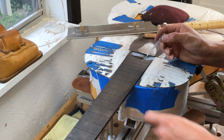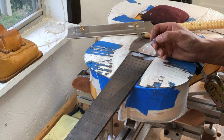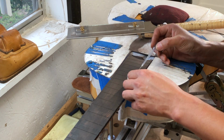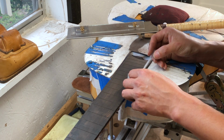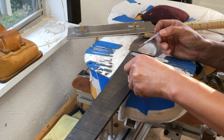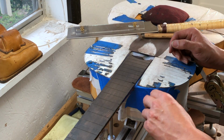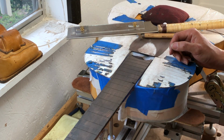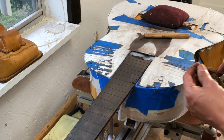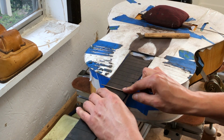Try to line the original chip up if possible. This is a super glue. And for the other one, I get some ebony dust in there. That's gonna be hidden under the fret slot anyways, under the fret, but I still like to have it clean. So I'll go through and check the rest of them, come back, clean that up. And for setting the triangle file, I'll show you how to do that. Just very lightly go through each slot.